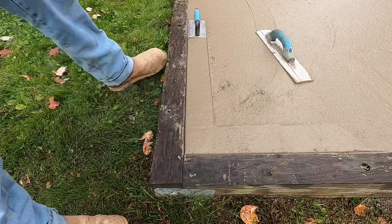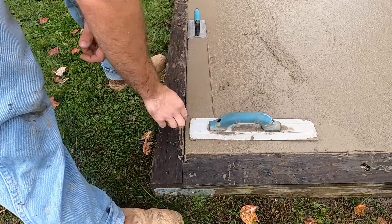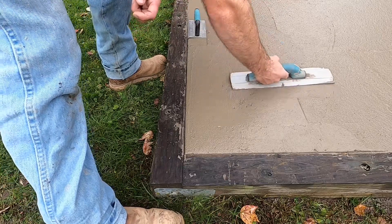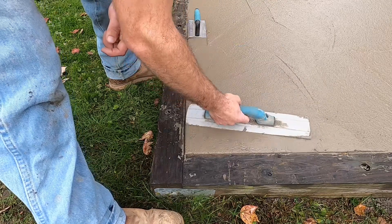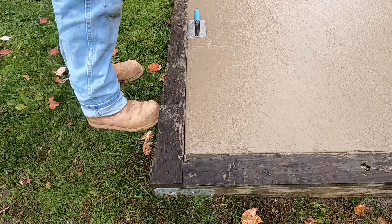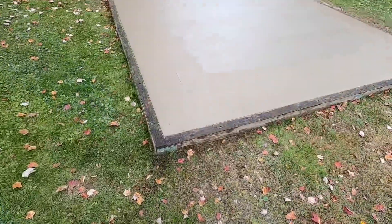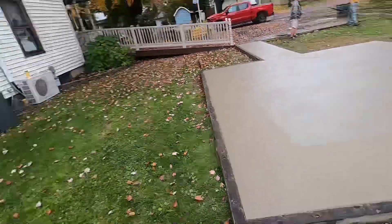When you're done with that, be real gentle with your mag. I always leave about a finger space and just wipe that edge mark away. Shouldn't be too hard. If you're pulling cream, make sure you fill them holes back in — it should just be a light drag so you don't interfere with what you just did with the edger. Light drag, and it should be nice and smooth. All done — bull floating and edging. That's what it should look like, nice and smooth, ready to move on to the next part. If you have any questions, just drop them in the comments. Thanks for watching.